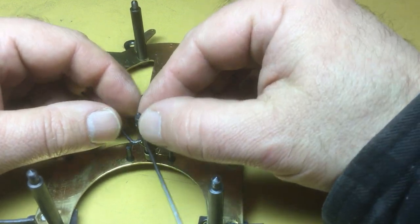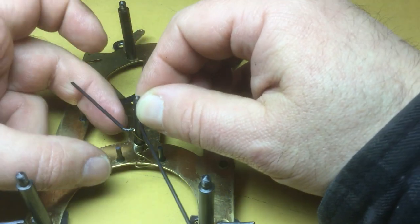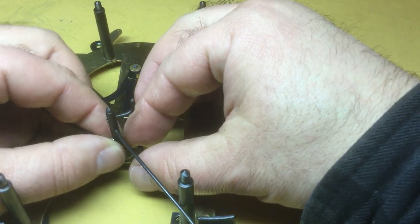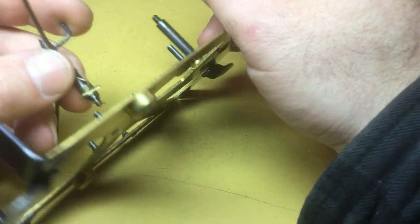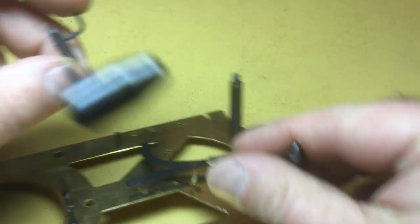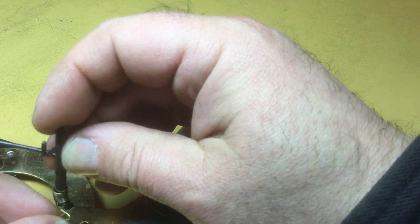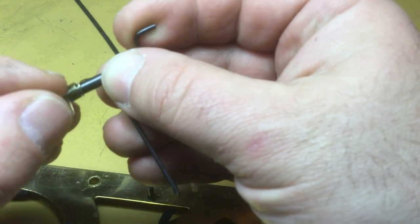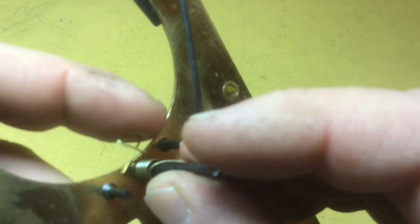it wrap at? And I believe this spring gets wound up and hooks, does not hook there like that. That does not provide enough return tension. Okay. But it's worth investigating to see where it hooks, particularly if you did not take note of that during the disassembly phase, which I rarely do. And to see where it hooks, I'm thinking you wind this up enough that it hooks back on the bottom side of the movement plate. That is fairly typical for these to do that.